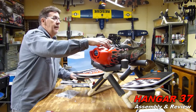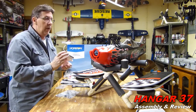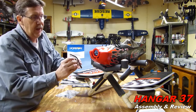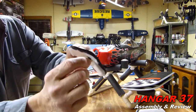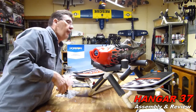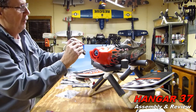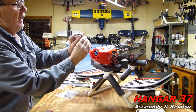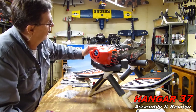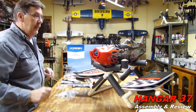One of the first things I did is I had to work the battery cover a little bit. This thing would not come out. I pushed it, it'd pop up, and you had to pry it - you started to ruin the edges on it. So I filed down just the very tip of the latch here, and that seemed to solve the problem. Also, these ends were sticking way up. This is somewhat pliable, and if you want to form it, it seemed to work. It all sat down in there nicely again. So it all comes out real nice, but when you get it, it may not act like that. You may have to file that latch a little bit.